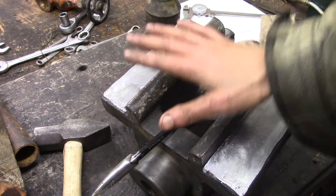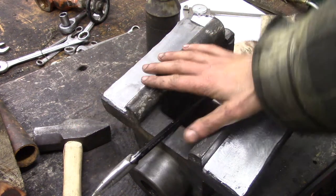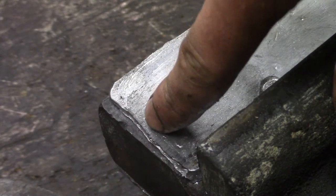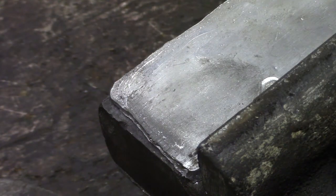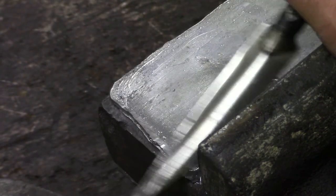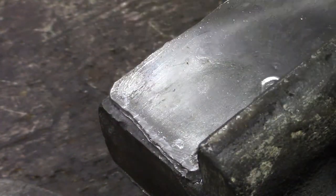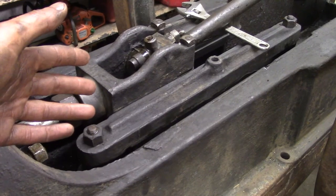Okay, so the piston is in. Now I'm going to do a little bit of work on the crosshead. I put it on the guide rails, moved it back and forth by hand a couple times, and revealed some high spots. You can see those scrape marks — that's a very small high spot — and there are similar marks on the other end and also the other side. So I'm going to scrape these down a little bit with my Babbitt scraper, just a little bit at a time, and put it back on to try to get a better contact area. I'm not going to take away too much because I don't want to remove so much material that this crosshead will be sitting lower than it should be.